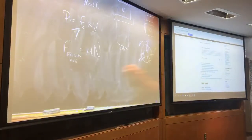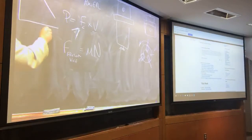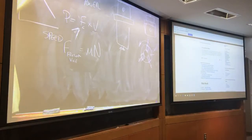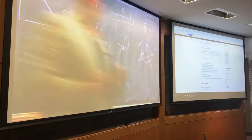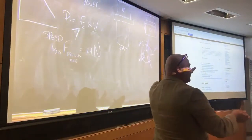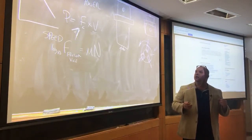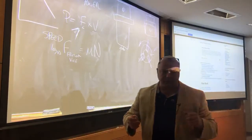So when you do that graph where you got a straight line, where this is speed, right? And this is life. This is log base 10. And that's why it's a straight line interpolation, but it's a straight line interpolation of the logs for the tool life question that people got wrong. Okay. I think that was the stuff we wanted to review before we got started.